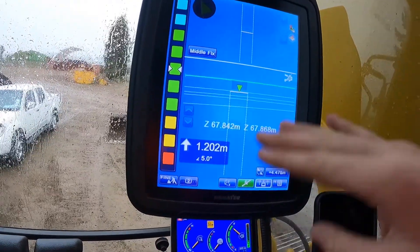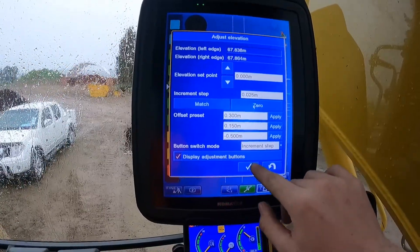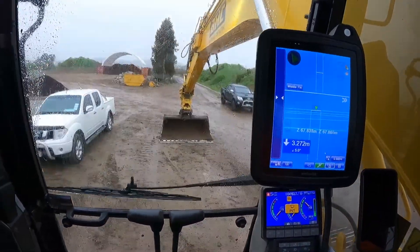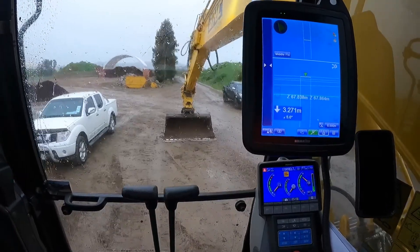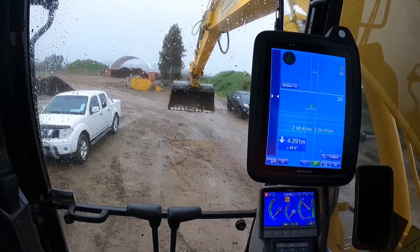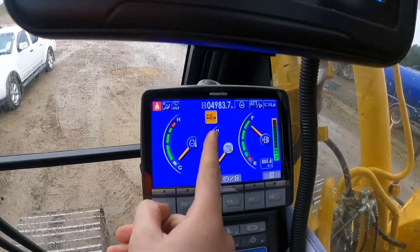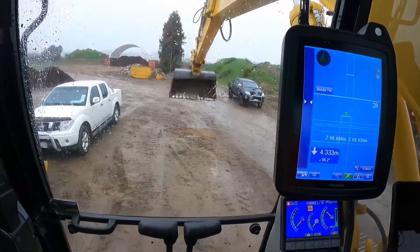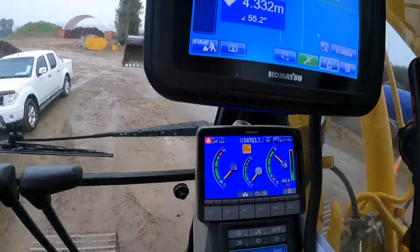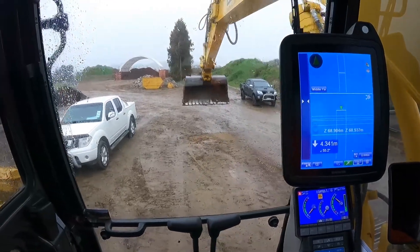You can go through here to adjust your offset — how high you are off the surface — so I'll just go zero. The surface I made was originally three meters lower. With these GPS machines when you turn them on, that little indication comes up and you've got to max out all your hydraulics. I'll usually put my bucket right up in the air with the hydraulics all maxed out and then that'll go away — I think it's just so the GPS can get an accurate reading on where the hydraulics are at for the machine control.